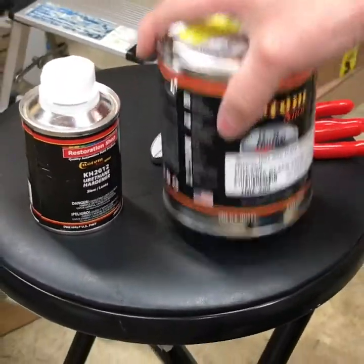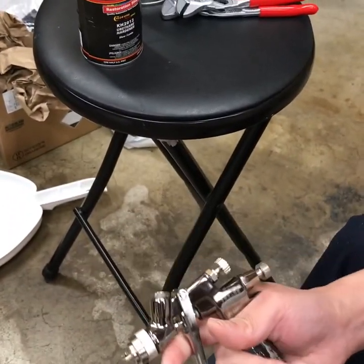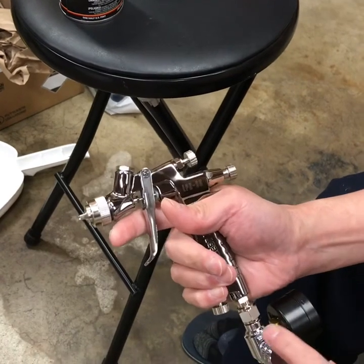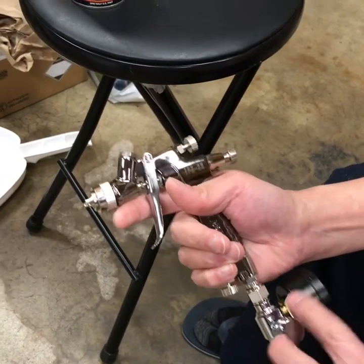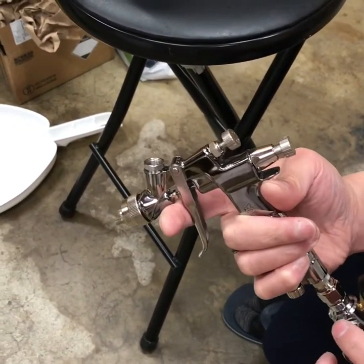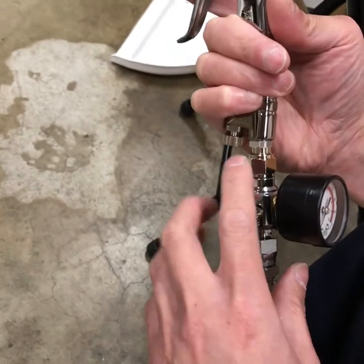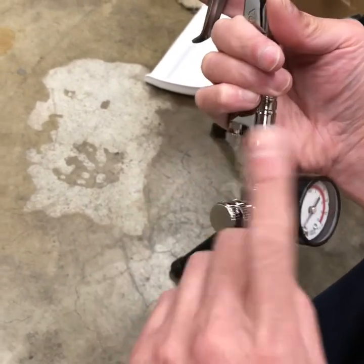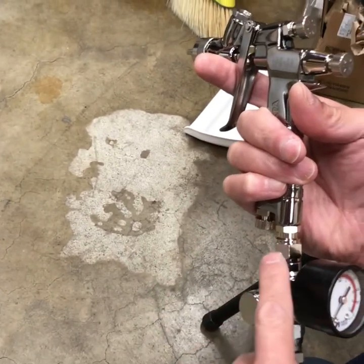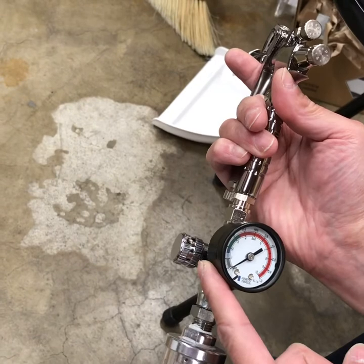All right, so a quick rundown on how to set up the spray gun. This guy has an NPS, and the regulator, of course, requires an NPS, meaning it's straight, not tapered. I've tried other brands, but it doesn't work. Although they have the same thread, NPS, it just continues to leak air. The product I was talking about was the Devilbiss regulator. The internal diameter, I learned, is different, so I ended up going for this guy, which is made by the same company.